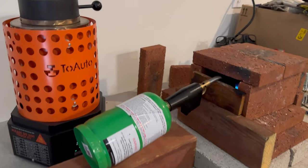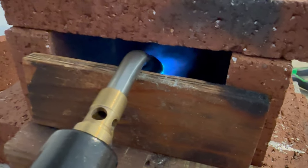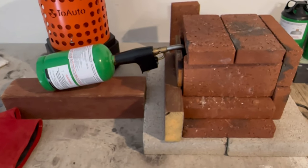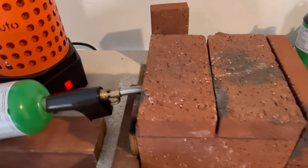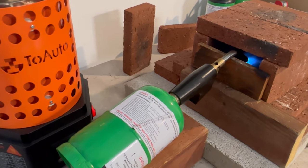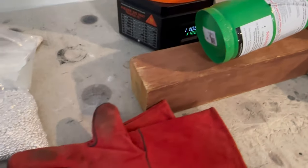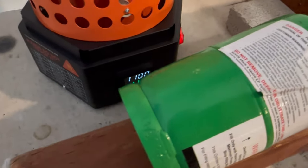Our pizza oven is all set up here. I create a little oven out of these clay bricks and totally encapsulate the mold so I can focus the heat on it and retain as much heat as possible. I've only ever used propane for pouring — it's significantly cheaper than MAP gas. I built this pizza oven around my mold to keep all that heat in, and it makes a big difference. I know you've heard it's important to keep the mold hot — using a little brick house makes a big difference. Put that kind of heat on a mold for about two minutes and it's hot and ready to go.